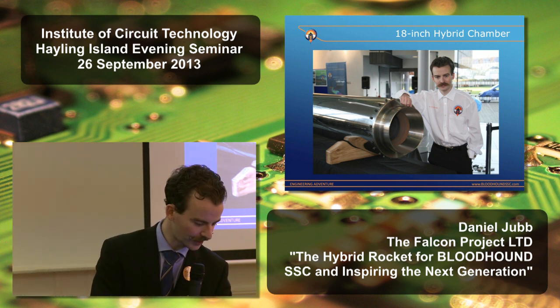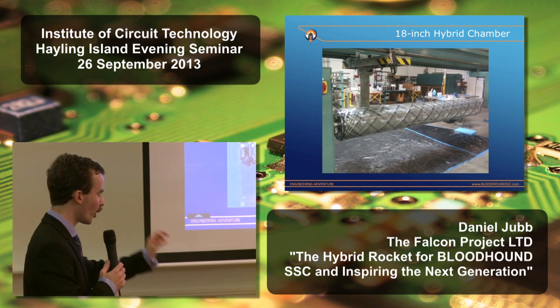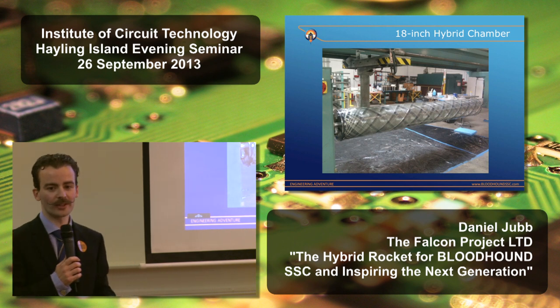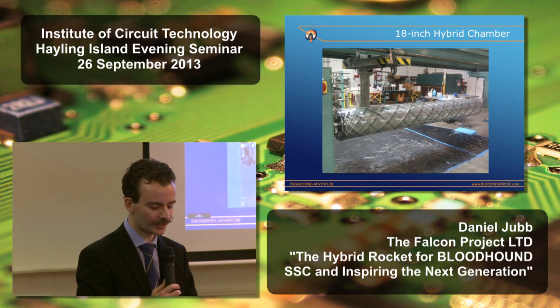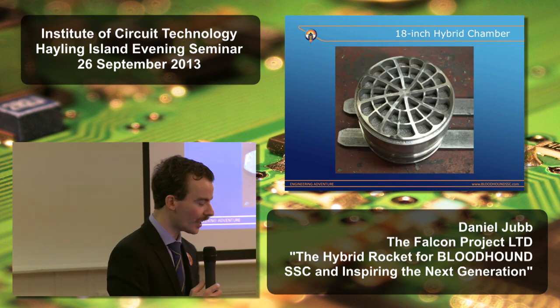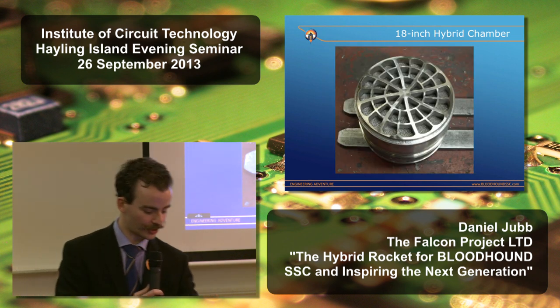But as soon as that was finished, it went to the US, it was shot blasted, and we actually filament wound glass fibre over the outside of the case. That's what actually gives it its capability to handle the internal pressure, which is about 800 PSI. So that's the finished full-size catalyst pack for the chamber.